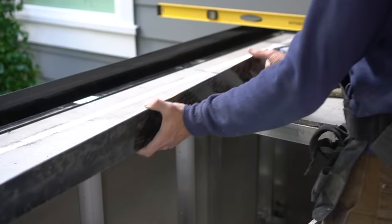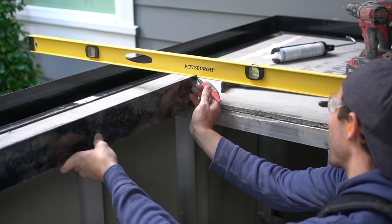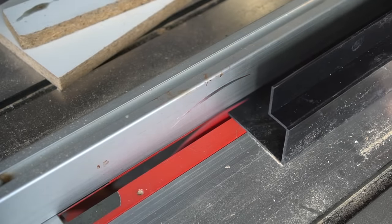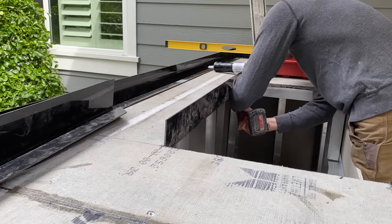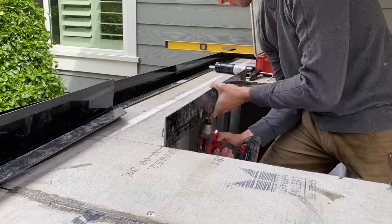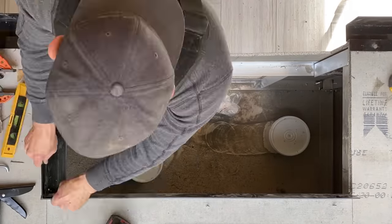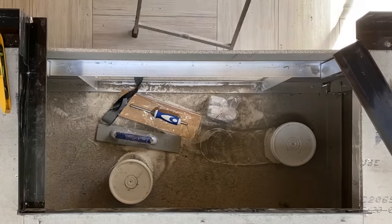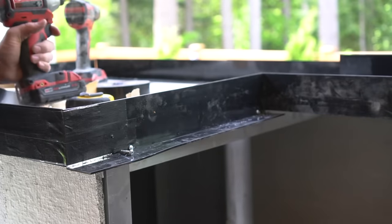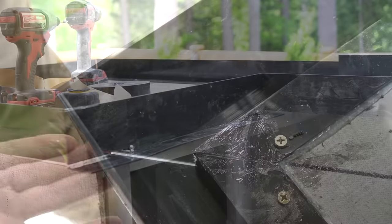The vast majority of all these cuts is just a nice 45 degree mitered edge. However, when you get to the center location where the barbecue is, that's a different story and a bit more of a creative process. I took my level and on both sides figured out exactly where the height needed to be, since it changes because you're mounting this piece to the underside versus the top side. I ran the formboard through my table saw and then applied a bit of silicone, attached it to the bottom side of the cement board substrate, and screwed it in position — and I'm able to remove it after I take the forms out. As you're installing the entire system, just ensure all the top edges are at the same height because we will be screeding over the entire surface. I also highly suggest siliconing the edges of that inside corner, because if you don't there is a likelihood that concrete could spill out into the barbecue itself.